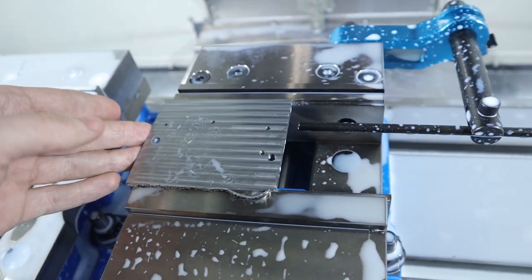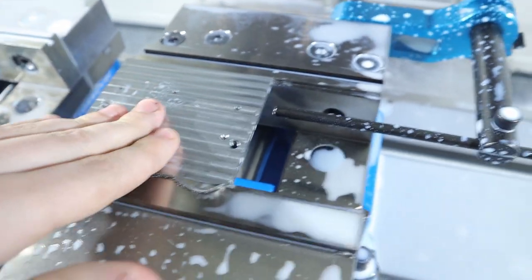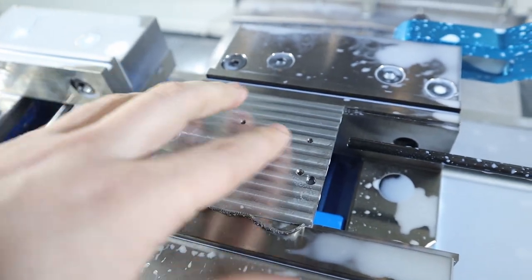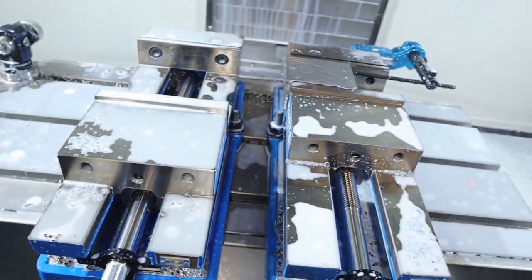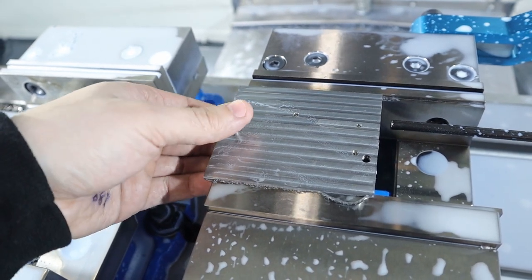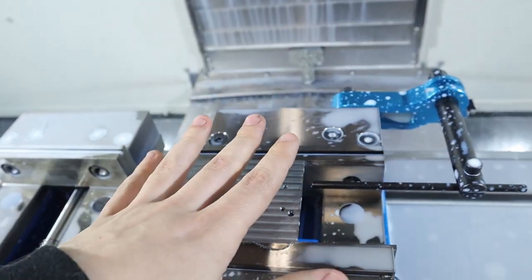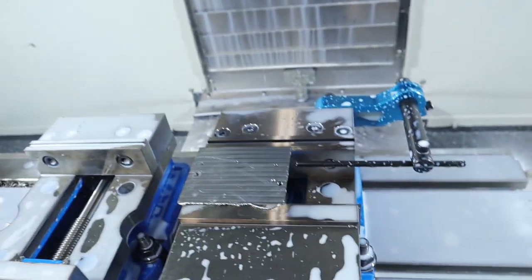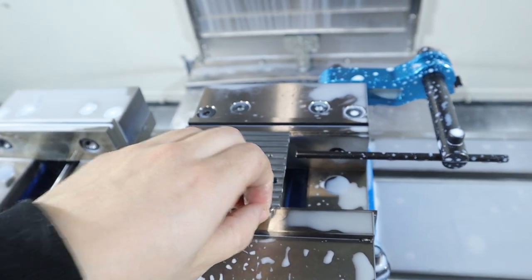So what I did was I said, okay, I'm not gonna be able to get the heights necessarily right, but I want to at least see if the process works. So here's a stock finished. We got the fixture holes and the pivot, which is obviously going to mount to our fixture plate. That has a little bit of slop in it, it's not supposed to. So I'm gonna mount this to the fixture plate and work on the tool paths for the handle. We're just gonna get a roll on and make sure the system works before I spend the next couple hours trying to figure out the stock BS.